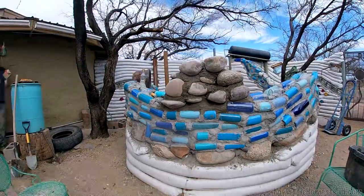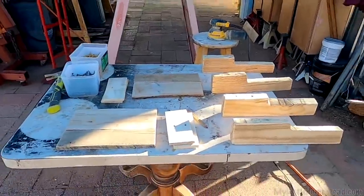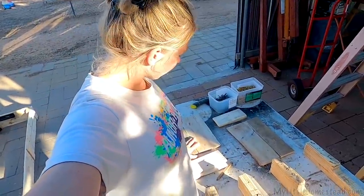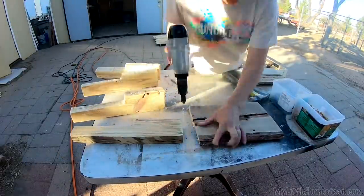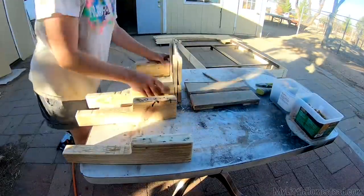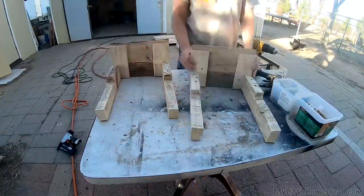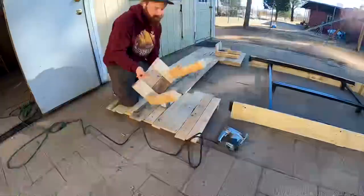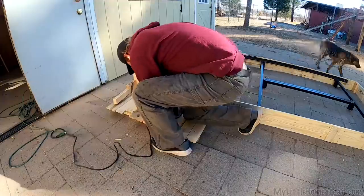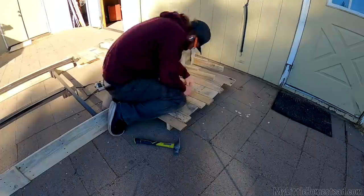Okay, I got all the stuff to make the shelves. I'm gonna go ahead and assemble them right here. And then when we're ready, we'll mount them on the headboard when we can see exactly where we want them. I'm gonna go ahead and mount the outlet boxes to the headboard before we mount it to the frame, because I think it's gonna be a lot easier to cut those holes and mount them in there when it's flat.